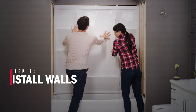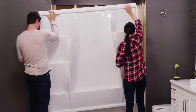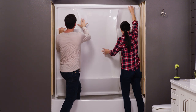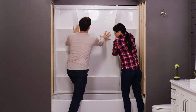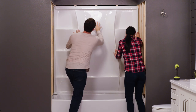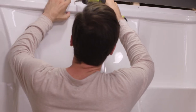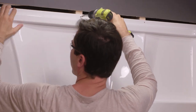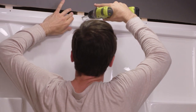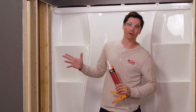I'm going to put my end in first to get over the plumbing, then swing the side in and press it tight to the wall, pressing all the way down each of the three studs and into the horizontal bracing. Now we're going to drive in the five screws across the top. Before screwing them in, I'm checking to make sure my pencil line still looks nice and level from where I previously marked it. It looks good — feels nice and tight.